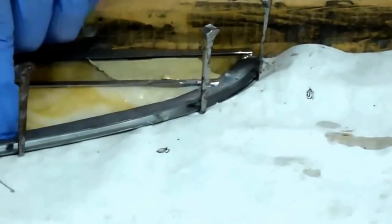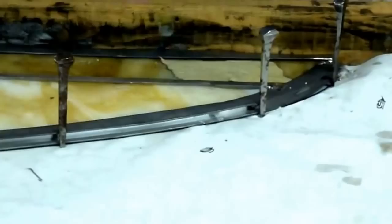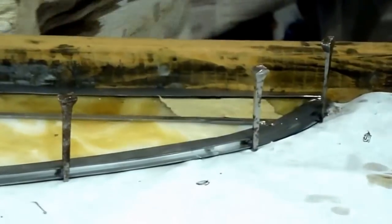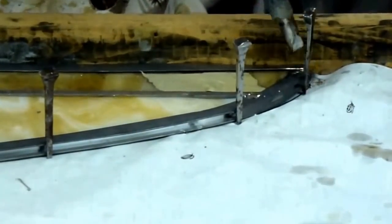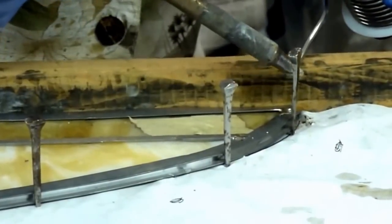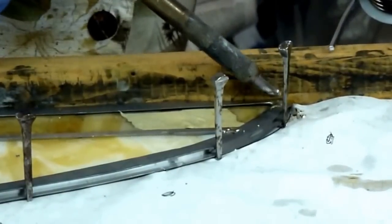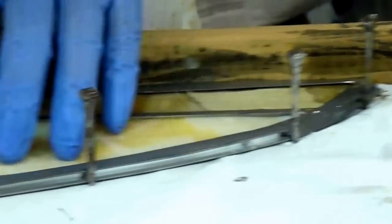This lead here is not the same age as this lead here. It's actually two different ages. So this lead that I've had for a little bit has oxidized a little. So it's taking a little bit longer to receive the solder. But not as bad as the really, really old lead though. Looks like I got all the joints, yep.